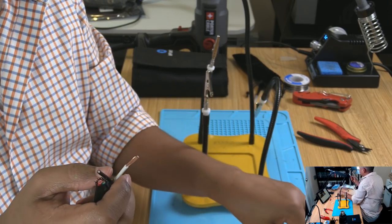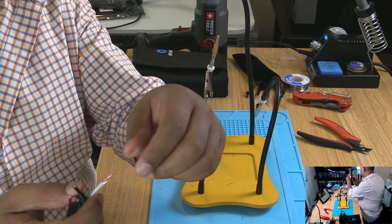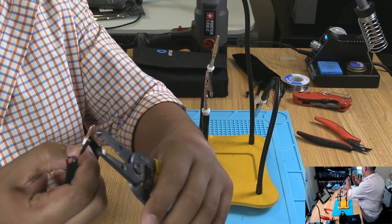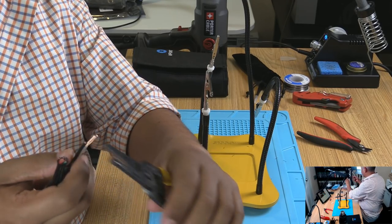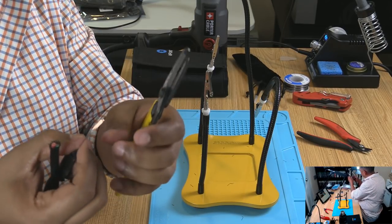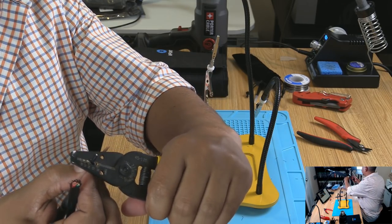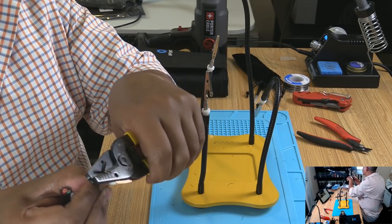What I found, if you go exactly with the right gauge of the wire, oftentimes you'll strip it, and you'll wind up with extra, like, broken pieces of copper, which you don't want. It's happened way too many times, and then I have this thing cut way too perfect. I would have to bring this down, bring that down. I don't want to deal with it, so let me see here. Let's do it for this one. So we'll go to 12, let me line it up so they're the same. Lightly twist, go 90 degrees, 12, twist, even though it's 14 gauge.